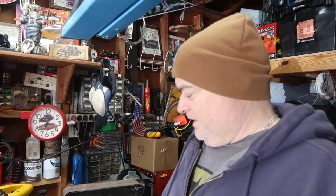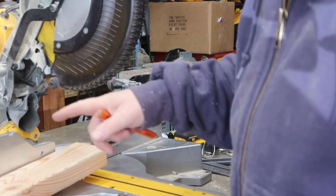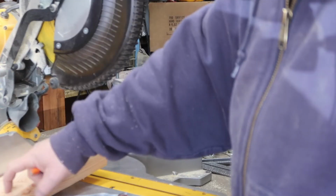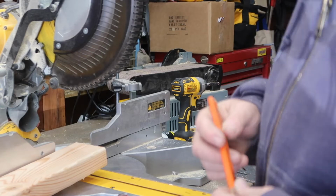Okay, so I'm gonna set it about 2 inches in, which would make the width of my leg from the front here where I'm gonna stand to the back wall 31 inches, so I can cut the angle and get a full swing of my arm on the saw. Okay, so I'm cutting my beams at 28 inches deep, plus the 1.5 inches of each 2x4 on the outside will give me my 31.